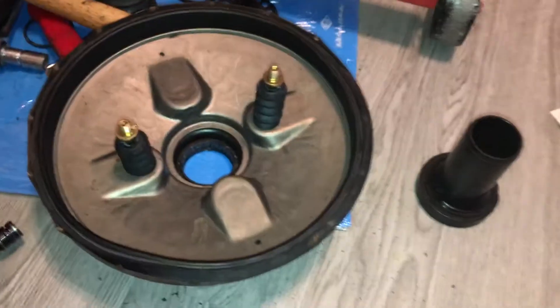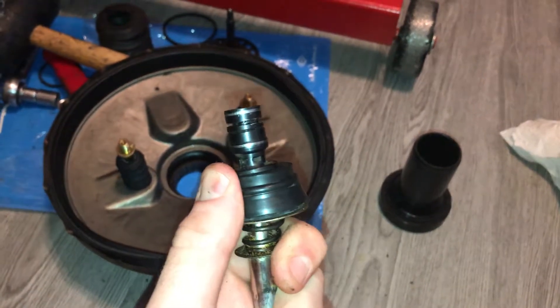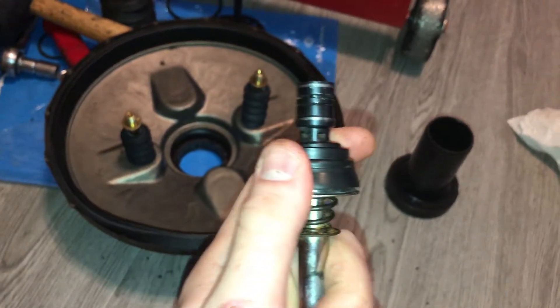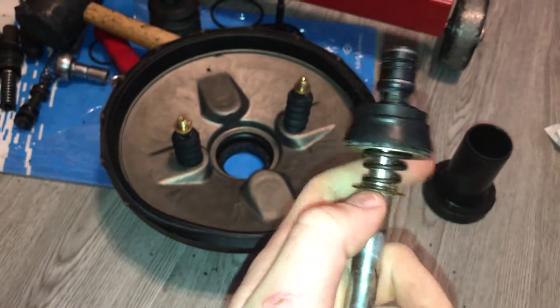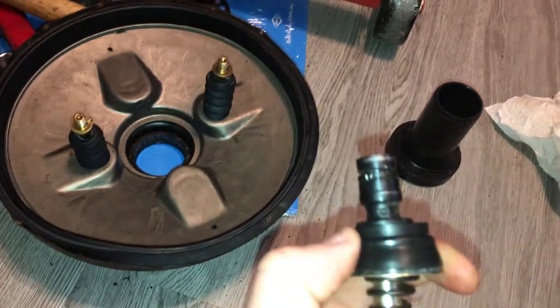So you need to look at what goes inside it, which is this. This is another part that I kind of just dismissed as a seal with a spring on it that just moves back and forth. It is, but it's actually a little bit more than that. If you look at this, there's a little perch here for the spring, and then there's a cup and a seal. And the seal, when you press it down, it expands. So this part would remain stationary in the bore — there's a seat for it on the inside.